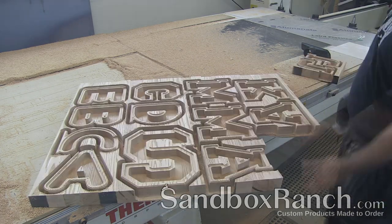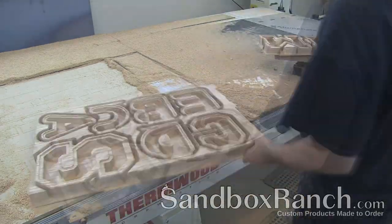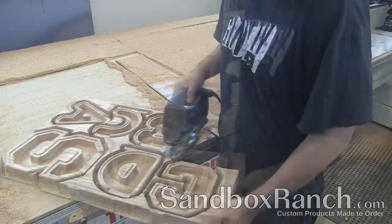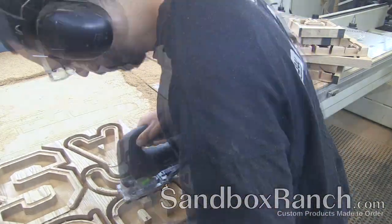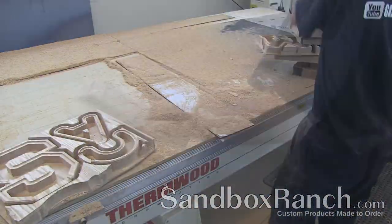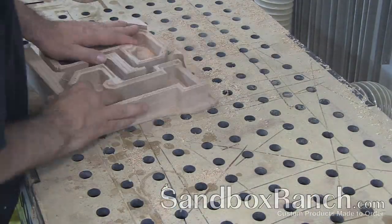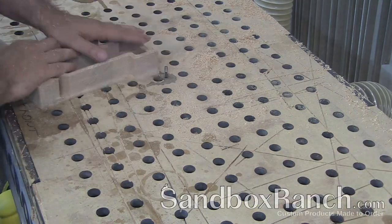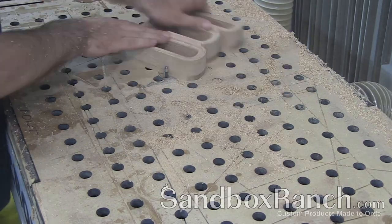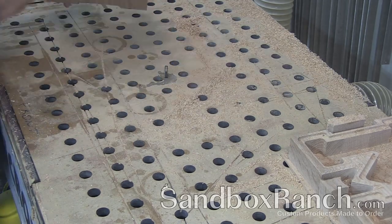It had been fastened in the previous section showing how I do these — carving out the outline. After I change all the bits, I go back to the first roughing bit, carve out the outline, and then go back over that again with the finishing bit. That's the nice thing about having a tool changer — you can use the same bit multiple times for different processes. The jigsaw work afterwards is a manual process, and as you can see, I'm also manually removing all the ledges all the way around.